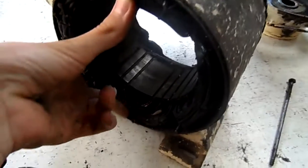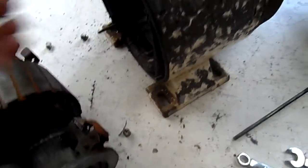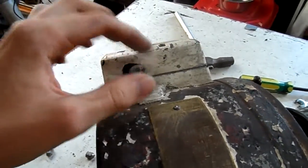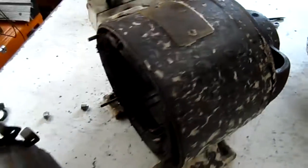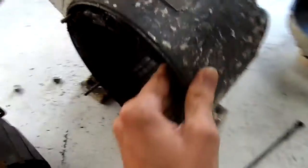I'm also planning on getting this rewound - the stator is very corroded. It's actually a two pole, not a four pole - it's one set of windings. The interesting thing was when I got it, these brushes weren't actually connected up - it was just the stator winding. You could hear it humming but it wouldn't actually do anything. I took the cable off because I knew it was non-functional. But hopefully I can get it rewound cheaply enough and get it to run again, because motors like this are actually becoming worth a fair bit of money now.